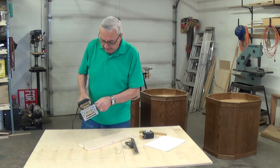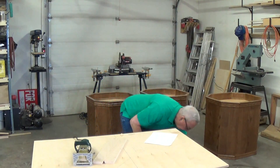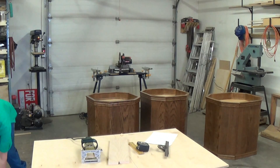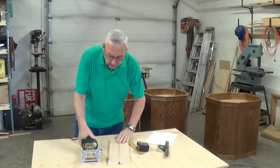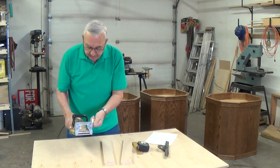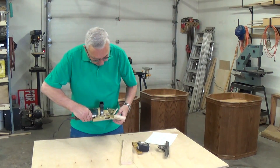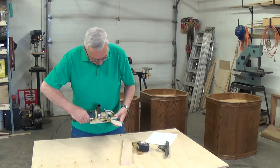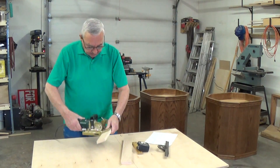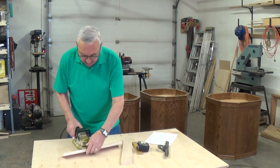Sometimes it's referred to as a biscuit groove cutter. I'll just plug it in. As you can see, we've already cut that angle at 22 and a half degrees on the table saw. So what we have to do is set this tool now to match that angle. The way we do that is just put the base - the face foot - against that bevel, so that this base is right parallel with that angle. This one here sits on the face foot. You just lock it in right there, and that'll be your angle.